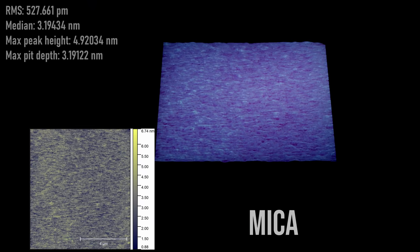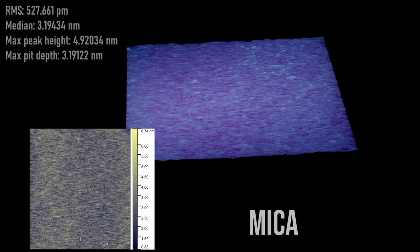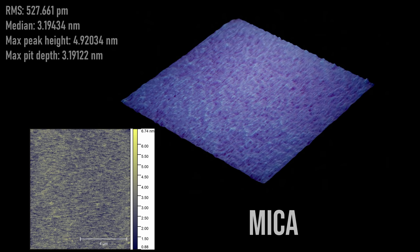The piece of mica that I scanned has an RMS of 500 picometers, which is a pretty small number, and the peak to trough deviation is only four to five nanometers in either direction. So this is a very flat sample, and some of it is probably just due to noise or my inexperience with scanning, because this was actually probably the hardest sample I've had to scan yet — which is ironic in that there's nothing here to scan, it's just a flat surface.